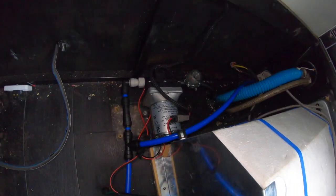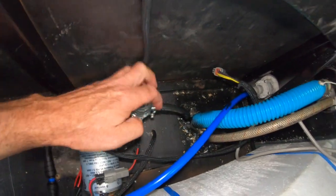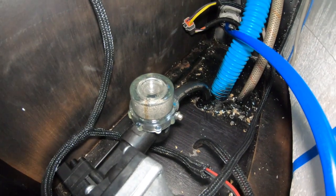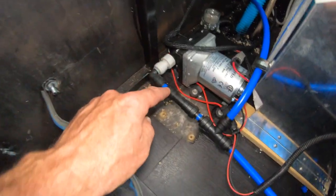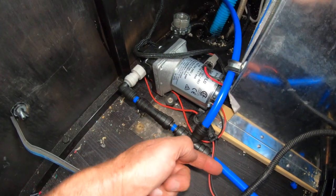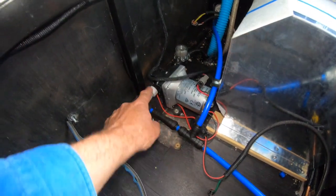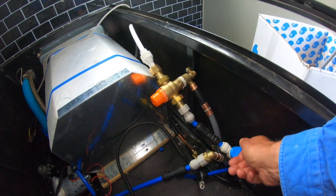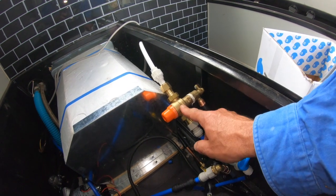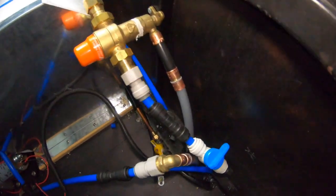I was able to tuck the pump just down this way a bit more so it's more out of the way. Here's the suction line - it's just got one joint going down. That goes underneath, sealed it up with silicone so stuff doesn't come in there. And this is the little inline filter - they're great. You can see when they're dirty, easy to clean - just take it out, clean out the stainless steel filter, and that goes into the pump. When the pump's working, it comes out here into the inline check valve, so water can only go this way. When you hook it into the city water, that's a pressure limiting valve and a check valve - water will come in but it can't go back up and damage the diaphragm in the pump. The water goes up to a T - that goes around to the hot water system, to the isolation valve, then up into the cold side of the temp valve. The really hot water comes into that white pipe, and then this one goes off to the kitchen sink and everything like that.